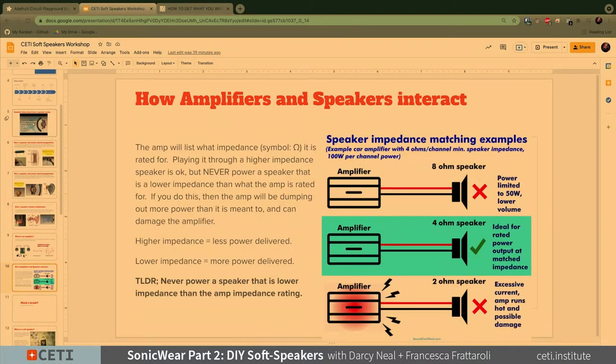The thing that you need to know about amplifiers is that they need to be matched correctly with the speaker that you're using. In this case, and for this workshop, we're going to be making our own. We're going to get into this really quickly, but I'll show you an image of the ones that we're going to be making, that you'll have a small one in your kit. This has a certain amount of resistance, and when you measure it with the multimeter, it'll tell you what the resistance is, and I'm going to do that on camera in just a minute to demonstrate.